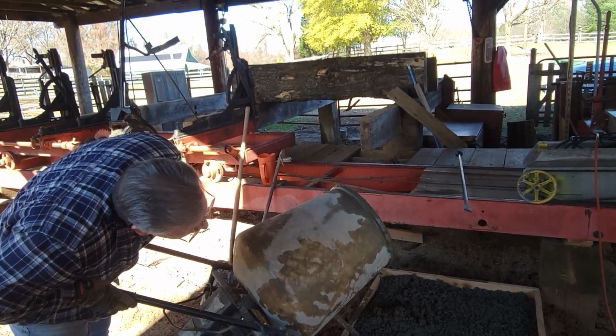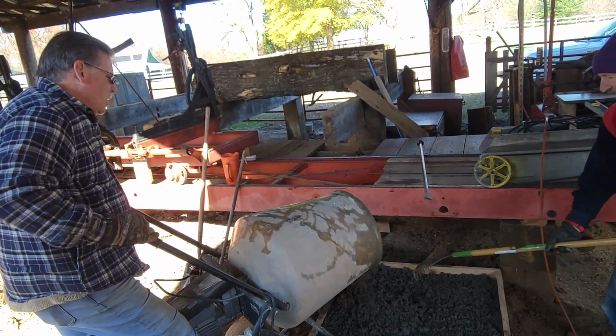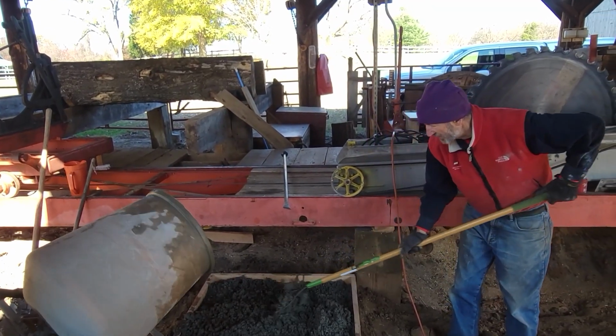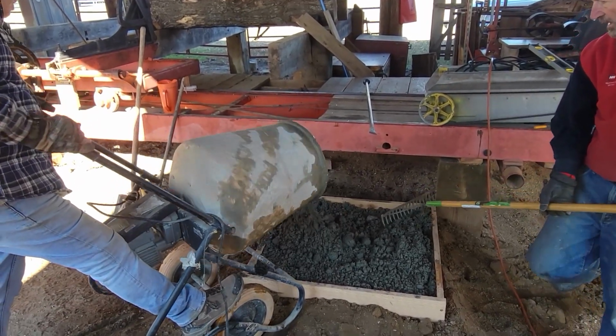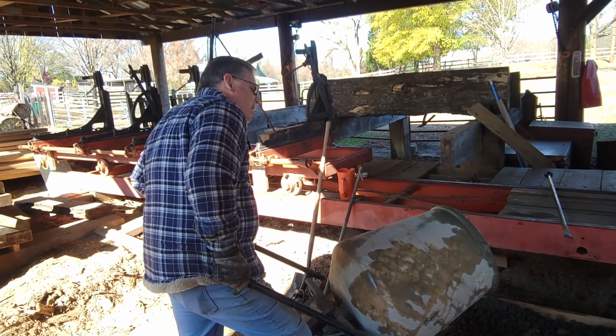So you're not going to watch us pour our sonotubes, but you'll have to trust me. They went just about 30 inches deep, maybe 28. The frost line here is 30 inches. It's a 12-inch diameter tube, and on top of them, what we'll do is we'll put this steel I-beam I brought the other day, and that'll be just wonderful. So anyway, that's a story.